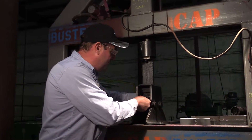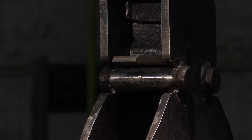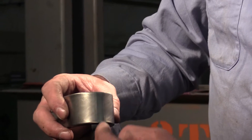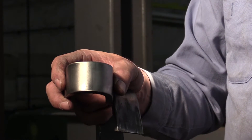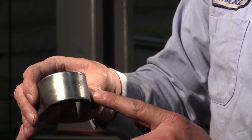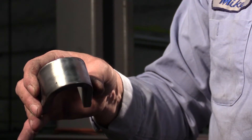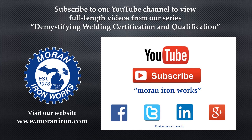One little flaw right there that's unmeasurable — it's smaller than a 1/32. It doesn't even count, so that's plenty good. No concerns there. Face bend — flawless. You can see the face bend is quite a bit wider, a little bit more wiggly where the weld reinforcement comes over the edge — normal look. Perfect. Not a flaw at all.